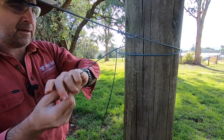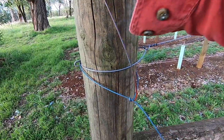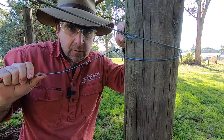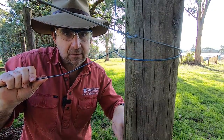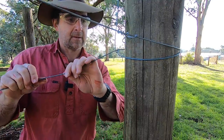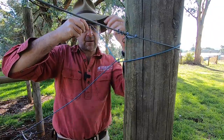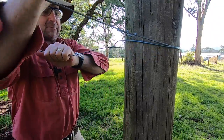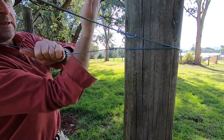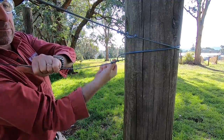Without crossing my line wire, I'm now going to pull up on the offcut so that it goes straight up the post. So we've gone around and through, down the post, and then swung it around this way to go up the post. Now that I've tied my knot, I can bend a crank handle in the end of my offcut and simply spin this around the line wire, securing my end knot firmly in place.